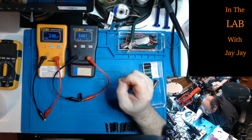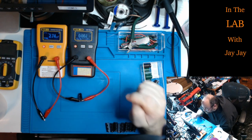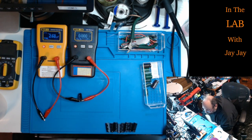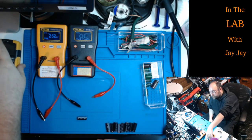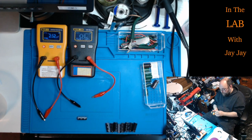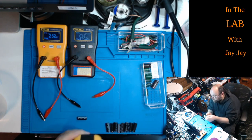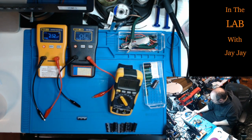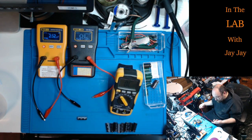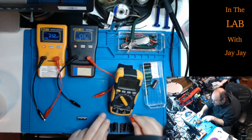And the ESR is low. Fascinating. So the ESR is low, but the capacitance is right out of spec. Wow. I wonder if it's just basically shorted out. I wonder what would happen if we tried buzzing him out. Let's put our thing back on. There we go. So he's on continuity, and if it's low resistance, it should beep at us. So let's give him a go. Got some cheapo probes here. These will do.